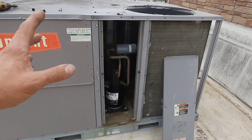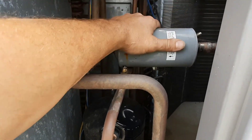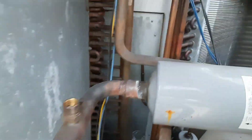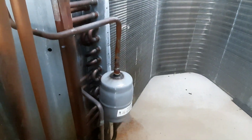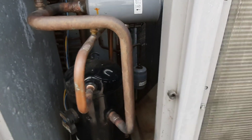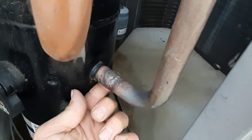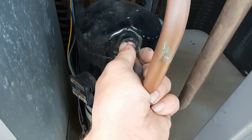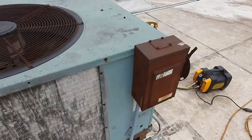I figured I'd take a minute and talk about a couple of things — signs that work has been done. Suction line filter dryers don't come from the factory like this, so if you see one, it's likely the compressor has been replaced. If you look back in here, you can see that dryer has got some burn marks on top of it, and it's an aftermarket dryer — looks like a Sporlan — so that dryer has been replaced as well. We can look at the welds on the compressor: this looks like a pretty good braze joint, but you can tell that's not a factory joint. You can see it's filled in that little piece because they popped it out at one point and put it back in.